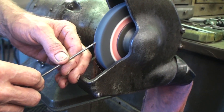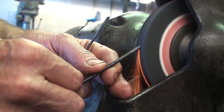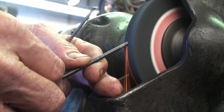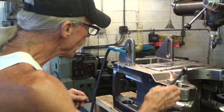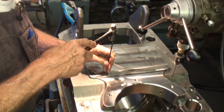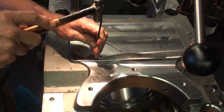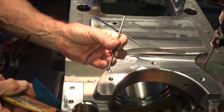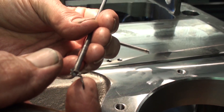Grind it at approximately 45 degrees — that's one rod I'll use. Two different size hardened rods for this job. This size I'll use to get started tapping out the remaining portion of the threads. What we have remaining are the remnants, which are basically the flutes of the tap. We take our sharp, round, hardened chisels and start picking the pieces of the tap out. These are also magnetized, as you can see — they grab those pieces, not all of them, but some of them.